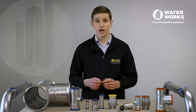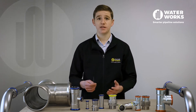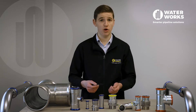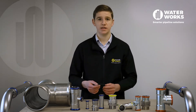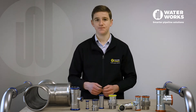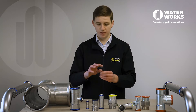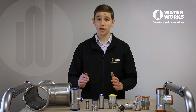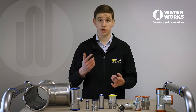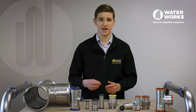Without this design, a join could seal under low pressure without being pressed. This means an installer could, for example, pressure test a system at low pressure and it seals, then down the track there's a pressure spike and the join pops apart. What makes the Europress LBP seal unique is the multiple leak paths, ensuring an unpressed join will leak at very low pressure compared to alternatives with one or two leak paths, which require much higher pressure for the join to start leaking.